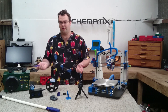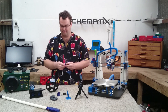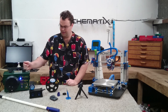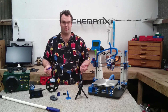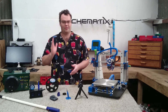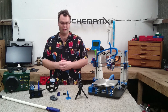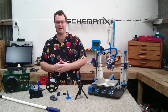This can be a pro or a con — if you want to illuminate some plastic, that's great. I've used it on this Bluetooth speaker here for a power indicator light, with an LED and a PETG-printed diffuser. But it doesn't look as nice as a completely opaque plastic such as ABS or PLA in some prints. Sometimes you can see straight through the shell layer into the infill and see the lines where the infill meets the shell layer.